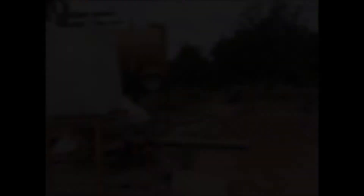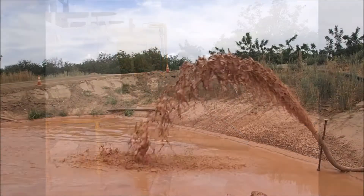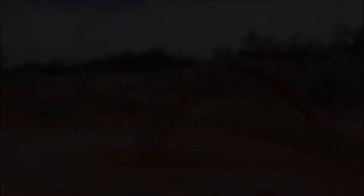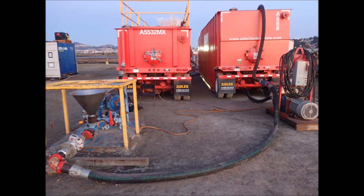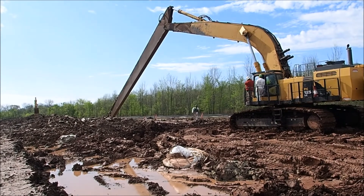Where space allows, we'll create a small pond and use a high shear or flash mixer to get the bentonite into solution. We'll then recirculate it to maintain homogeneity. When we're much more limited for space, we'll use the very same type of flash mixer to get the bentonite into solution in a series of tanks, which are also recirculated to feed that well-hydrated, homogeneous product to, in this case, a CB plant. That's all fed to the trench.